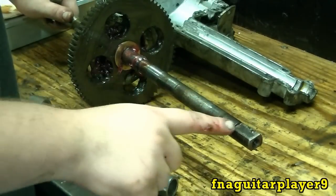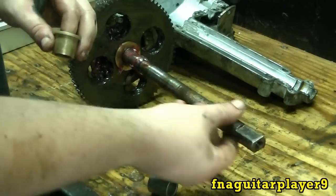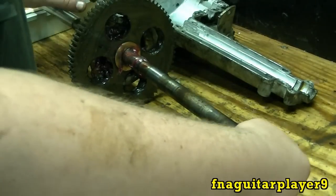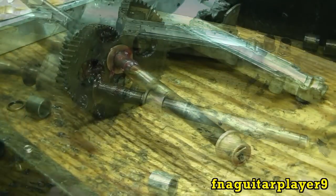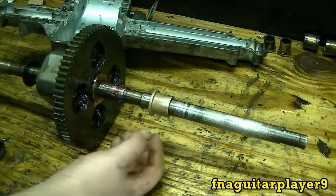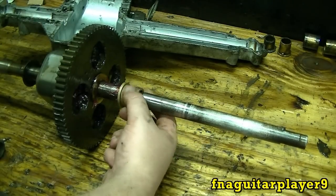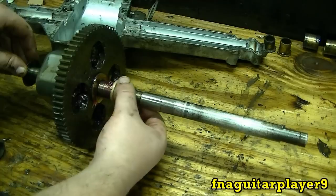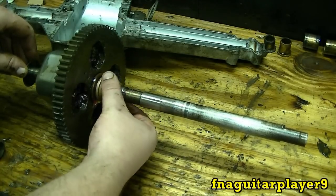You should clean your shaft a little bit here with sandpaper — it'll make this a lot easier. Put a little bit of grease all over here, that'll help slide it in. I finally got it on there. What it was, it had a little edge on there. I had to sand it down and ended up cleaning the shaft a little bit. So now I'm going to put this on here, just doing this to make sure the grease gets worked in real good.